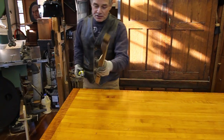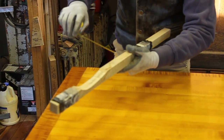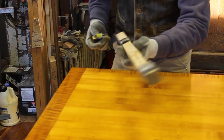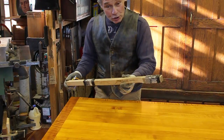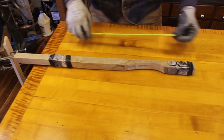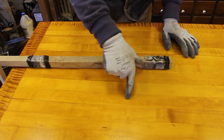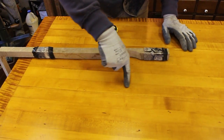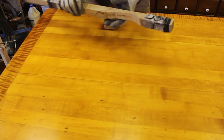You need to make yourself a tool — just a simple wooden stick. As I measure it, it's one and a quarter by one and a quarter inches. You want to make it out of hardwood — hard maple or preferably white oak. The fixture is 28 inches long. You want to cut an arc of about a four-inch radius, or eight-inch diameter, and you'll see why that's cut there.